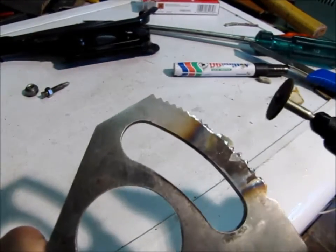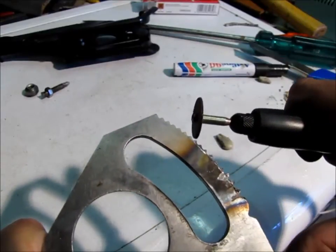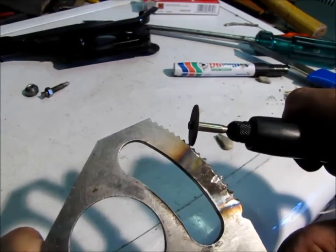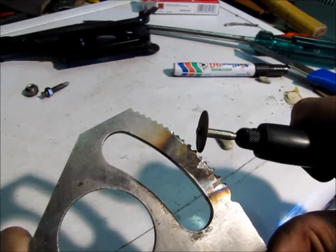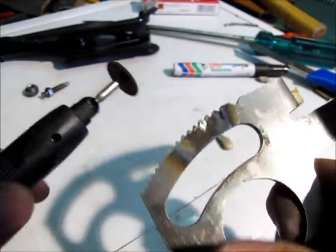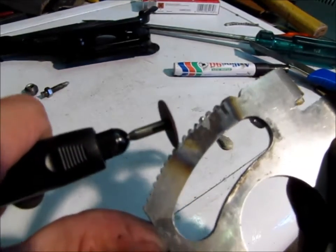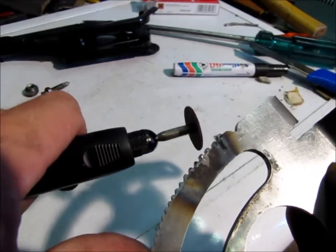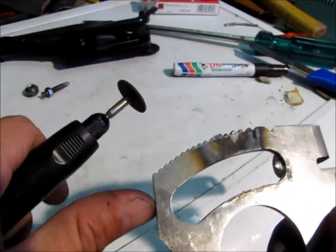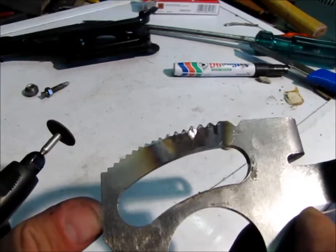What I've actually done is I've used a scribe for my angle. I used the existing teeth and made a series of cuts, rotating it around to get a feel, working to the markings I made with a marker — and I did the same thing in the other direction. All you can do is get it as close as you can. I'm sure there are people more skilled than me at this, but I'm just demonstrating the idea. We've yet to see if it's actually going to work.